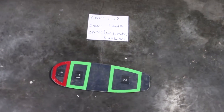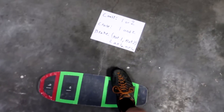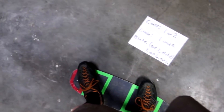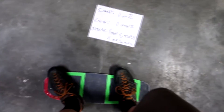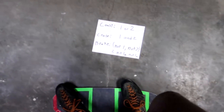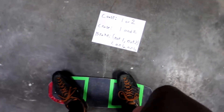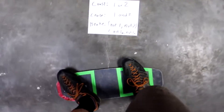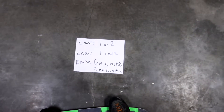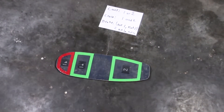One concern with braking: if this board is sized with a small battery and small motor, it might not only lack the power for a lot of braking force, but it might not have much space to store the energy recovered during braking. Using regenerative braking you can put energy back into the battery, but if your battery isn't large, you may need another way to bleed off some energy without putting it back in.